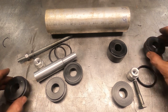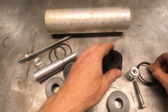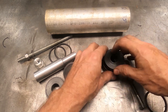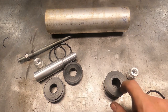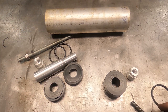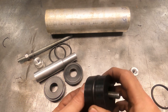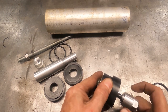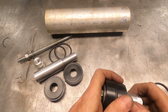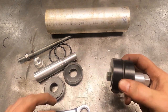Here you see all of the components we've created. We take a couple away because the interior cuts on the sample piece are shorter, and we want all components recessed into the end to access both ends for machining features. We take one compression ring, fit it with an o-ring, add the compression washer, then put large washers on the back side since the hole is three-quarters of an inch — that way the compression rings fit on either end, mandrel or tailstock. We put our bolt in, take the nut with the cone on the end — that cone sits in the three-quarter hole on the compression ring to keep everything concentric. The head of the nut has a 60-degree taper to accept the tailstock; the opposite side fits into the ring. Then we tighten this together inside the tube.